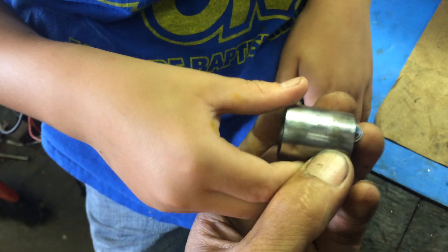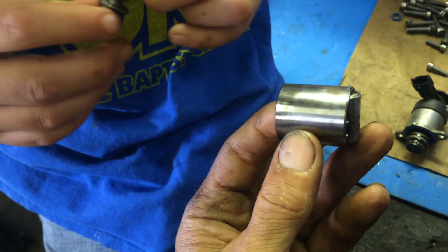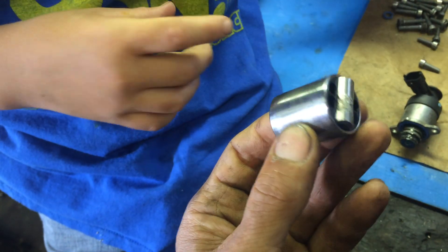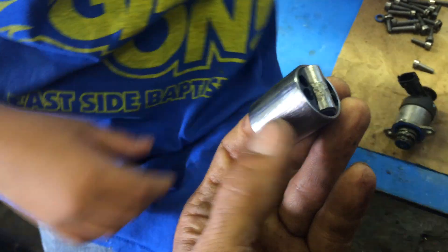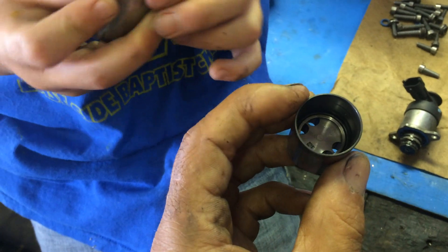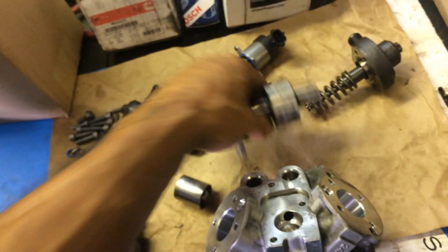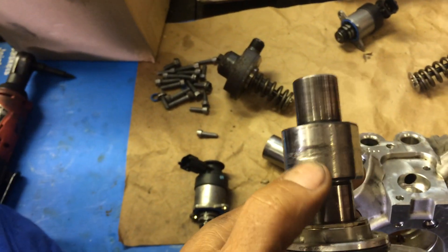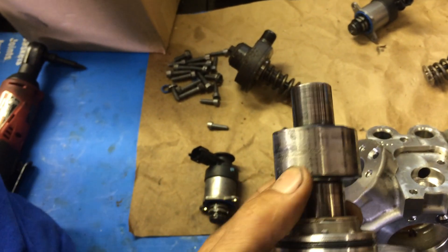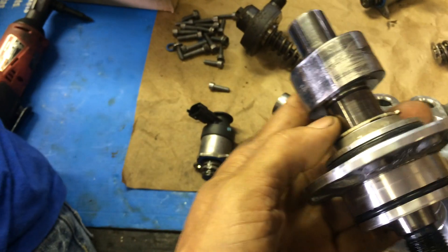As you can see here, there's some scoring on the outside of the plunger. That transfers out to the fuel pressure control valve — this one's even worse. There are two lobes of the cam, and you can see they're both ground down. No rust anywhere, but lots of scoring from the metal and heat.